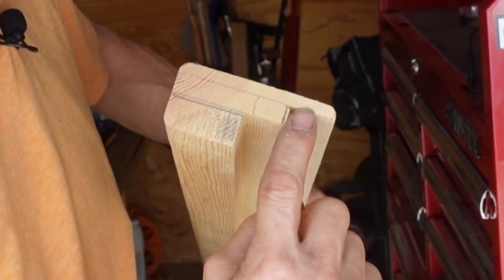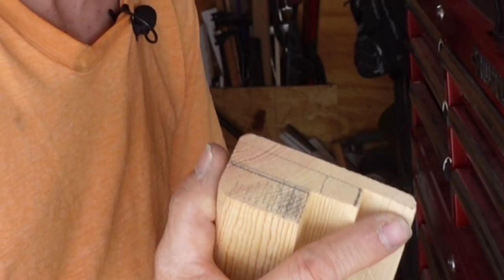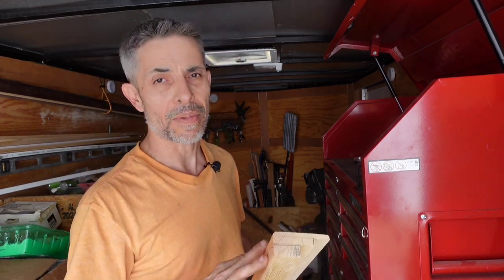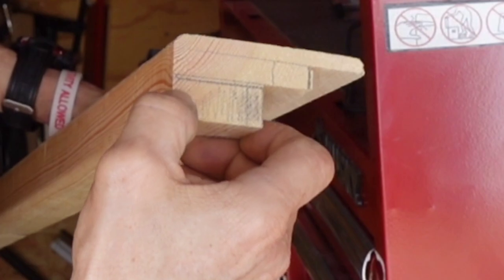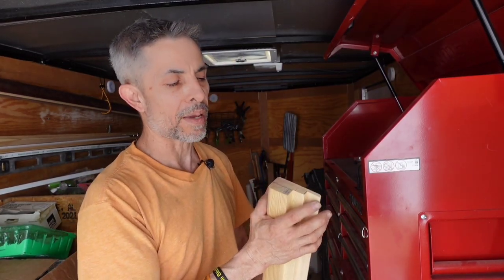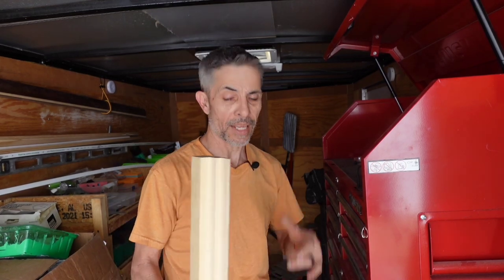What's up DIY fam - we are back and it's the next day. It got a little late on me last night, but I did get the stair noses started. So this right here is my quarter of an inch - this is the part I made a quarter of an inch. I wouldn't go too much less than that because there's a point where it just gets a little bit weak and we don't want it to break. Even though this part will be set on the floor and glued down, we're not taking any chances. This part right here will lip over top of my laminate, and then this sits on the floor - that's the thickness of the laminate plus a little pad. I'm going to cut this nose down a little smaller and it'll lip over top of my riser. There are three of them to do: one long one on the angle and two straight ones.